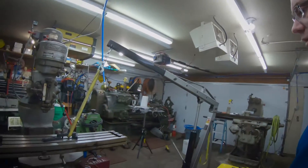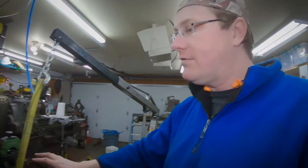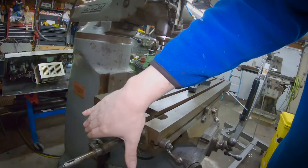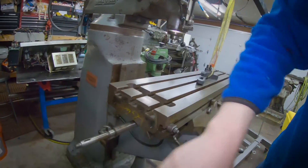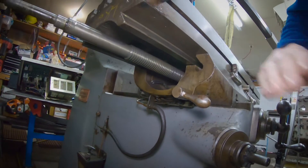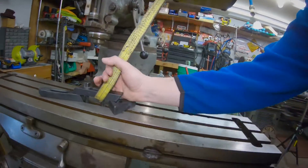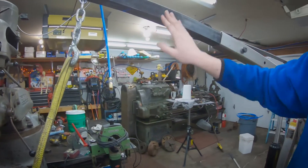For anything I do, I suspect it's probably going to be accurate enough, but I kind of want to up my game a little bit. I think I may just go ahead and get this guy cleaned up and sell it, or use it as a beater. Anyway, we're going to pull the table off here — pull the two crank wheels off, there are four bolts on that little casting that pops off, loosen the gib which is right there, pull the gib out, and then you can just take the table and run it back and forth by hand. I've got my engine hoist on it and we're going to slide it off and set it on my table over here.